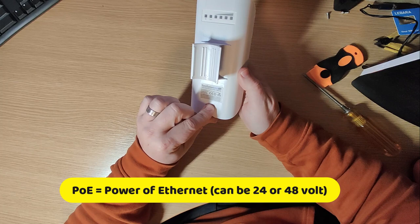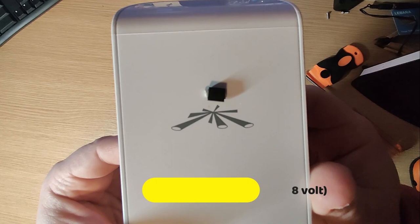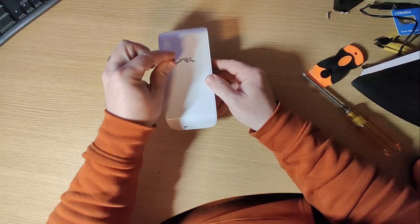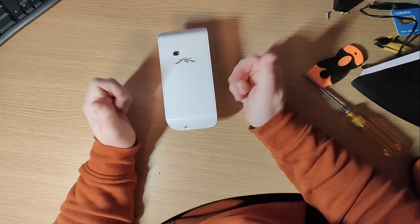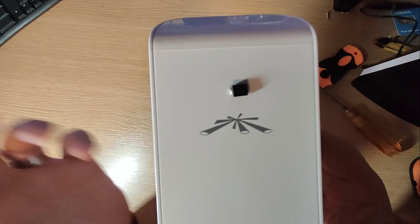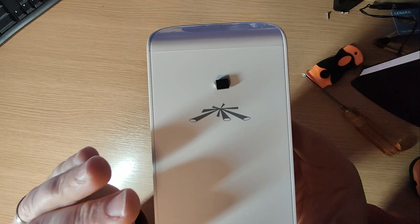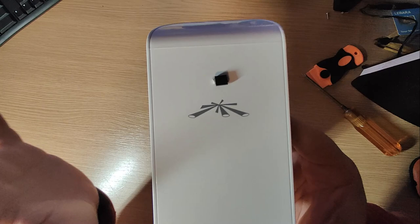What I've found online is there's a tiny little chip — a diode — which I've already removed from this device, which you can see here. All you need to do is remove that if you've overpowered yours and it's not powering up correctly. Replace it and it should fire back into life. This is a transient voltage suppressor diode. For some reason they put one in that will only resist up to around 35 volts. It does two jobs: it stops you destroying the circuit board if you accidentally apply the wrong voltage, and it smooths out the voltage if your supply isn't particularly well regulated.